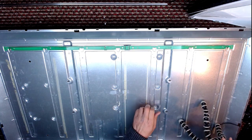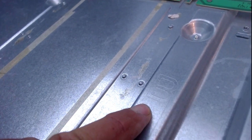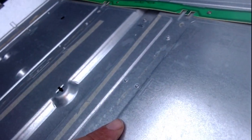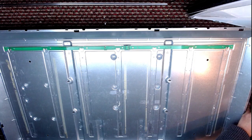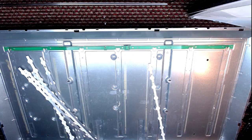You may notice — and I don't know if it's going to come out on the video — can you see it says B there? So there: B, and A, and B, and B, and A. And not just on Vestel — all television screens will have the backlights listed. All the numbers or the letters or whatever it should be, usually engraved in.